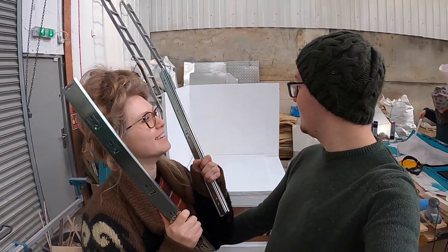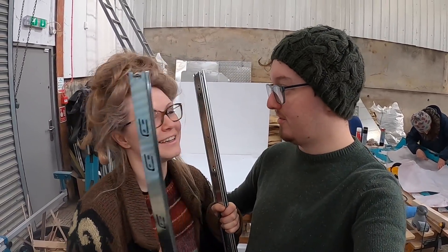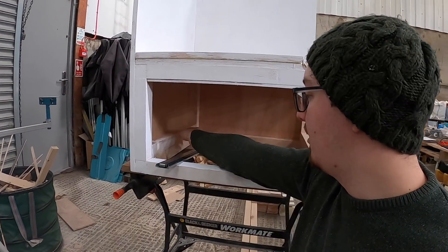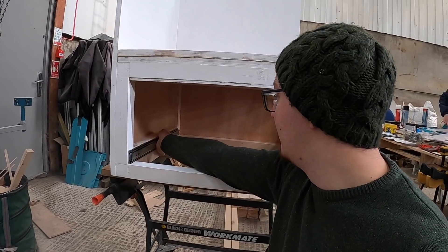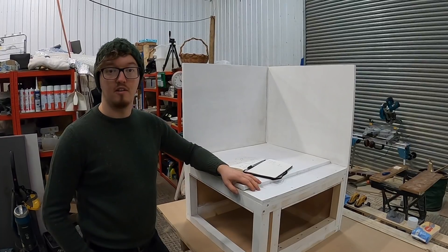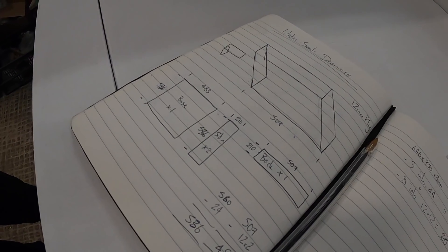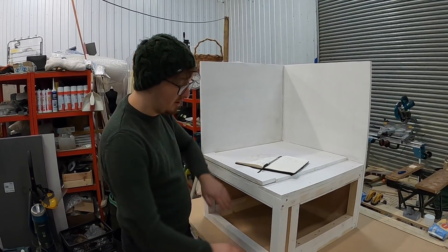Today we are on to building the drawers under the seat boxes. I'm really excited because this is the first proper bit of cabinetry we're doing, and I can start filling the van full of stuff. When we were building the seat boxes we added extra bits of timber to the length of the drawer — that's what our drawer runners are going to attach to. We're going to work out quite how the drawers are made and then fit them on there. We've sketched up a rough design: we're going to use 12mm ply to build a base, sides, back and front in a box, with drawer runners attaching it all together.